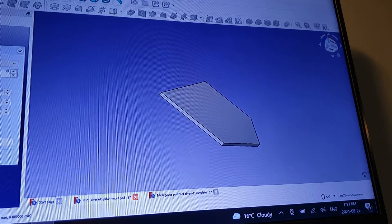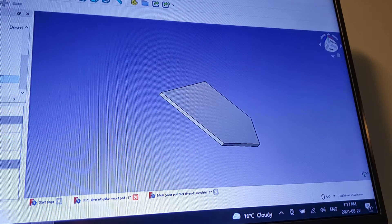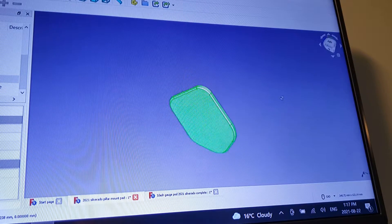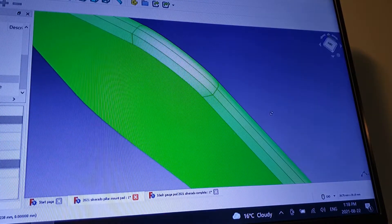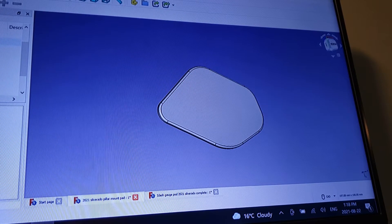The rough design looks a little crude, but with FreeCAD you can use the editor to round the edges out and also create some chamfers on the edges to make them smoother and look like a better piece. I started by printing out a very thin slice of the pad so I could use it for test fitting. Once I had it fitting 100%, I'd come back and make the pad thicker and then add the gauge pod itself onto it.